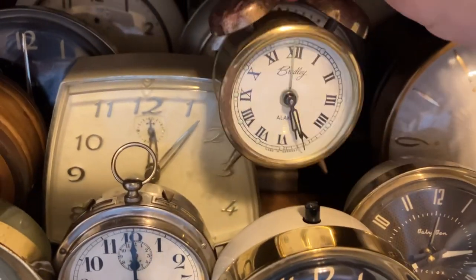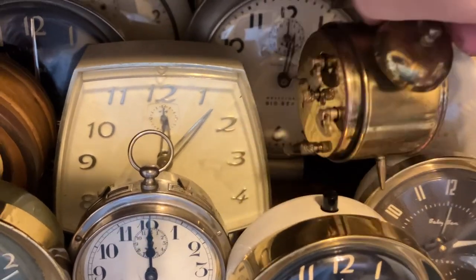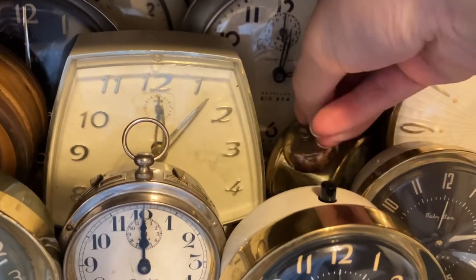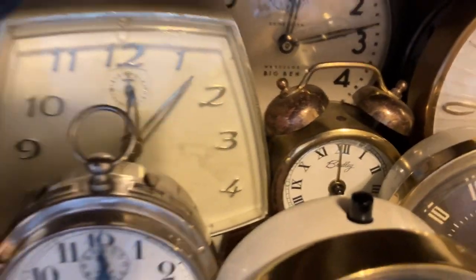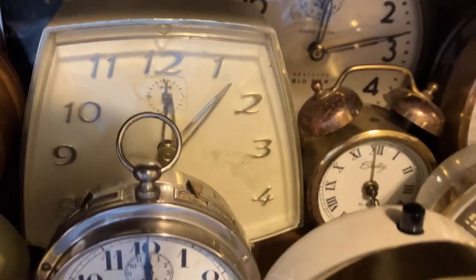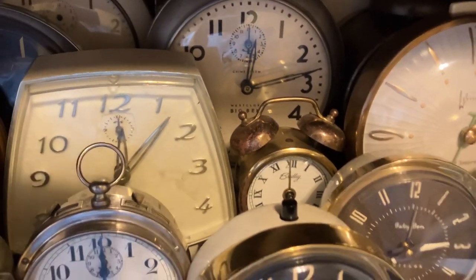This here is a little Bradley alarm — another little German travel alarm. This one's quite neat, though. I got this at an antique store — it was like a couple bucks. Ironically it was missing the taper pin and was packed full of dust, but a replacement taper pin, clean and service, and it runs fine.